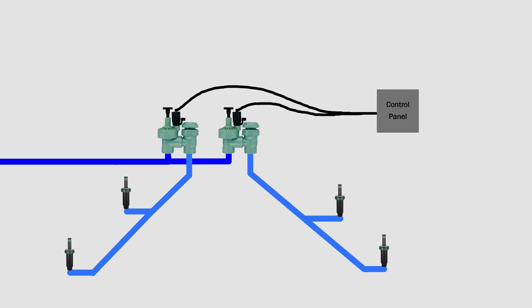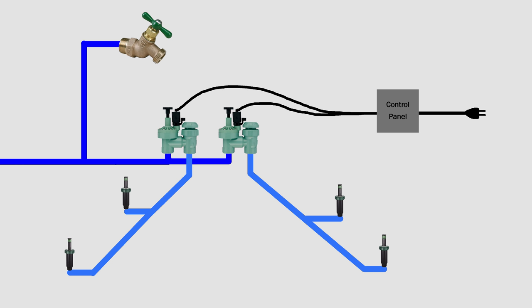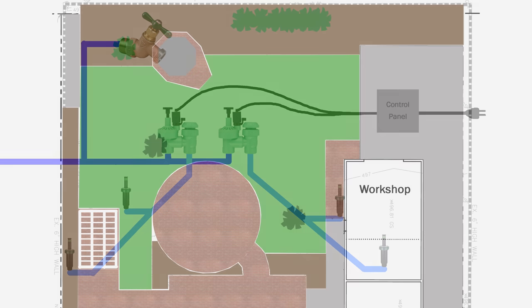The box has to be somewhere where it can get power. The source pipe can also be used to provide water to garden hose bibs, and there will be a few of those added to this plan. I'll be using PVC pipes to run the water underground. The larger the diameter of the pipe, the more efficient water can flow. It's good to go from larger diameters to smaller diameters, but going from smaller pipes to larger pipes will cause pressure drop and prevent sprinklers from working correctly. My source pipe is one inch diameter PVC, so that's where I started.